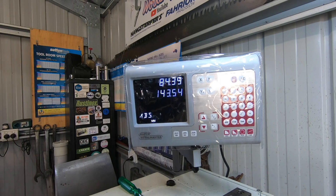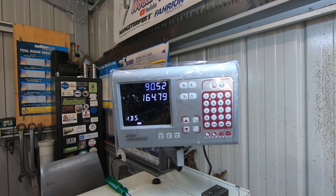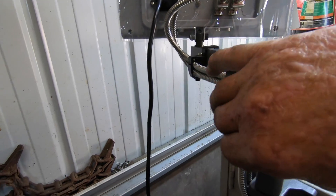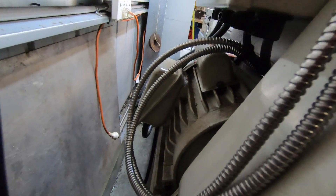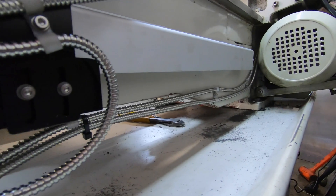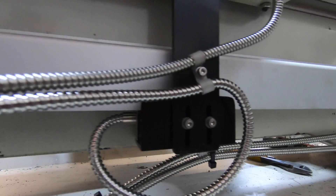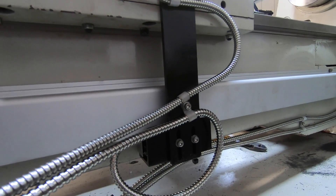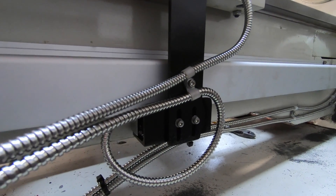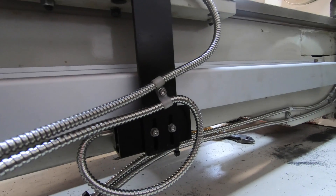It's probably flickering in the camera, but we have both axes working. The monitor actually looks pretty good. For cable management, they give you these brackets — they clamp together over top of a rectangle tube and feed down underneath the machine. It comes out from behind the motor on the lathe, along the bed, loops back around, and it's attached just under the reader. A few P clamps hold it all into place. So the carriage can go from one end to the other and nothing lays in the tray — it's not running tight or anything. It all worked out really well.